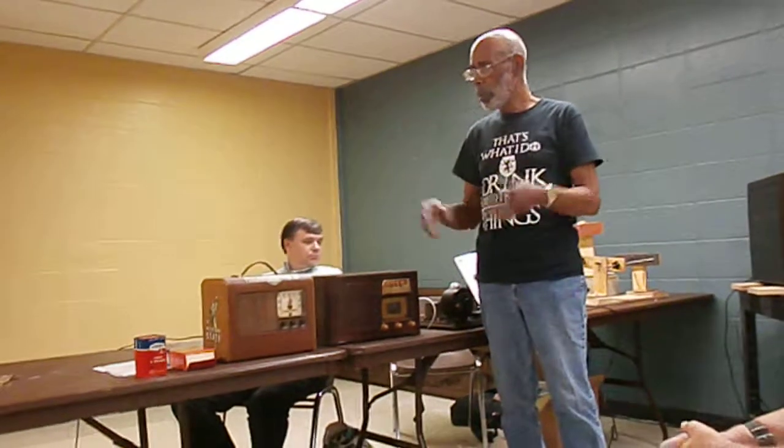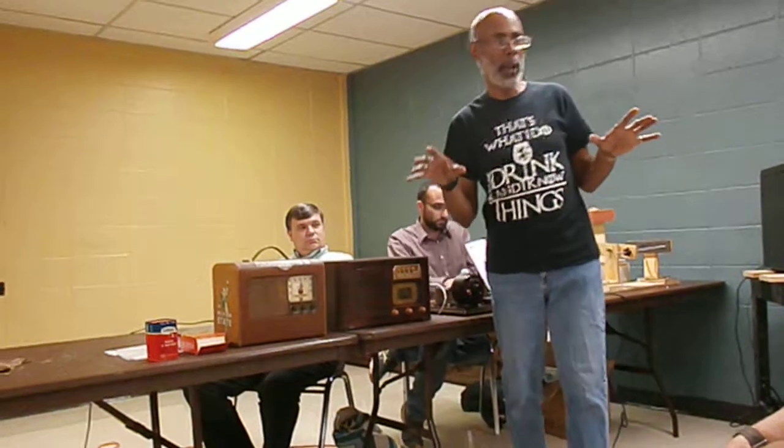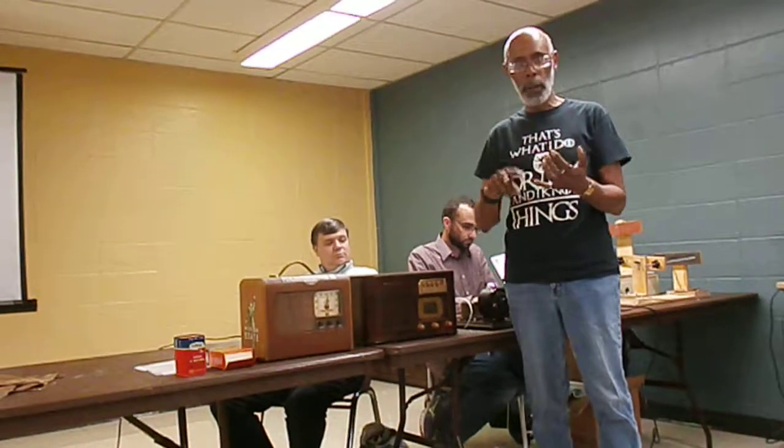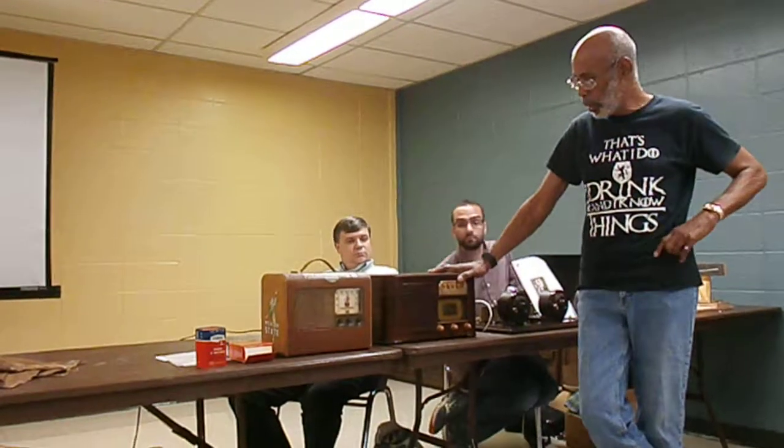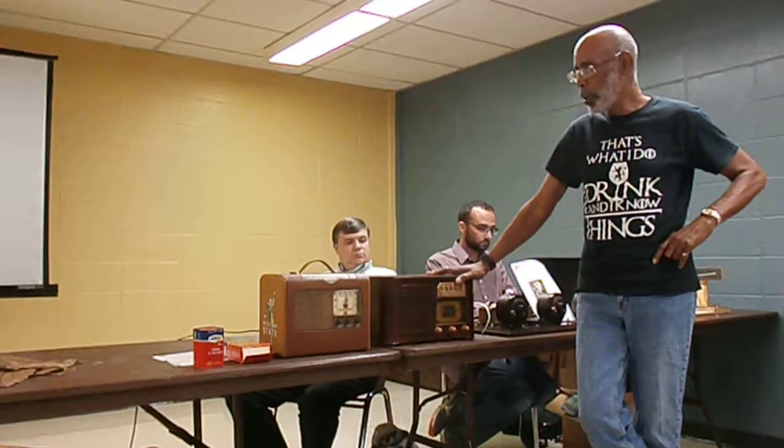And I put on the Variac when I got it. And you know me, I can't keep my hands off a radio. If it comes home with me, I'm touching it. If I buy a radio, I go right home and start work on it, and I can't help myself. So I go home and I put it into my test equipment, and I put it on my Variac, and I've got a current gauge on it, and you know, voltage and all that, and I start to bring it up on power, and I start to get a little bit of action in the one dial light that's in it. It has two, and I had to put another one in there. And I couldn't get it to play.